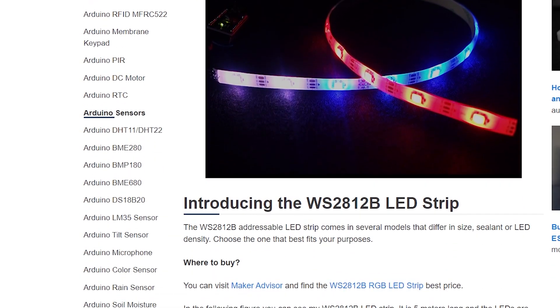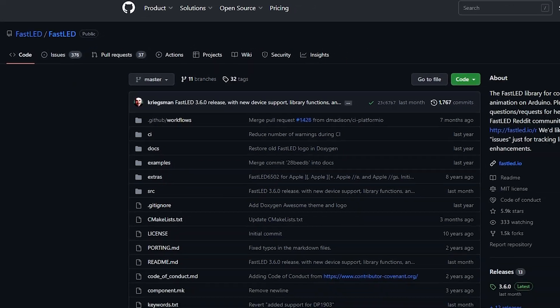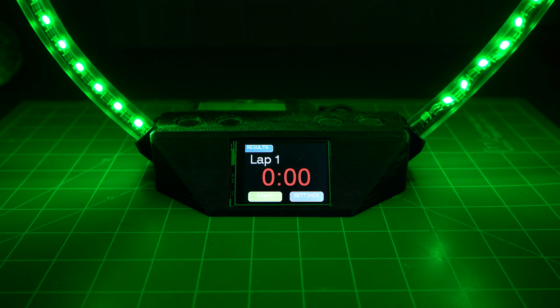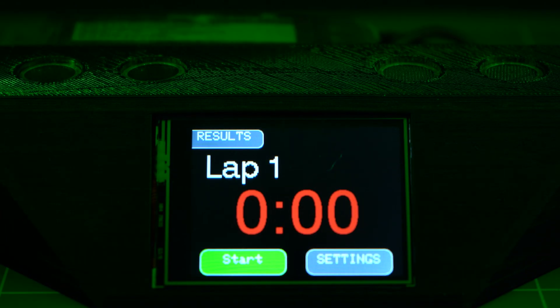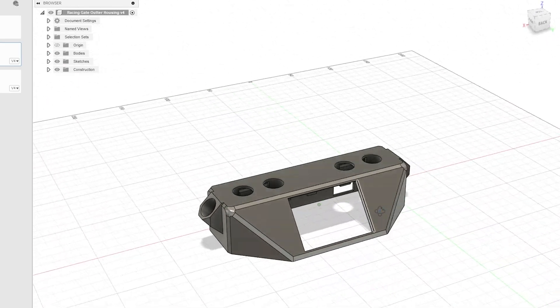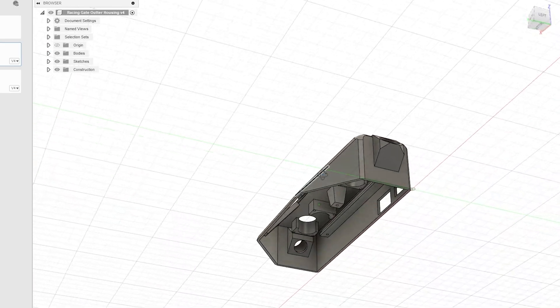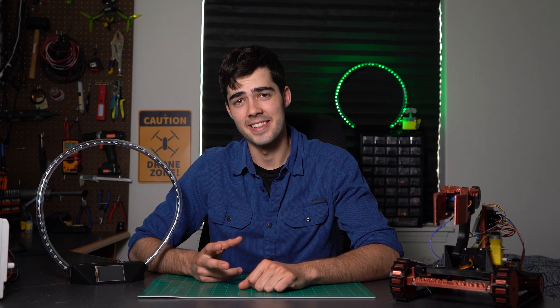Another returning feature is the LED ring, which is a programmable WS2812B RGB strip, super easy to work with thanks to the available code library. The new design centers around this brilliant 2.4 inch touchscreen display, which adds the interactive capabilities missing in the older model that featured a plain 4-digit display. Incorporating the touchscreen was mechanically simple — I just redesigned the housing to fit it — but the code to use it? Not so much. That's why I'm here, spending countless hours staring into the void of my computer screen questioning my life choices.